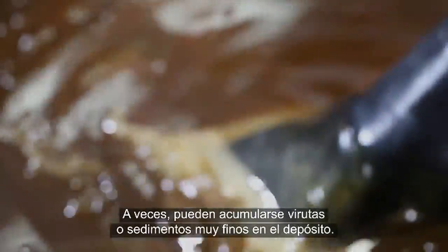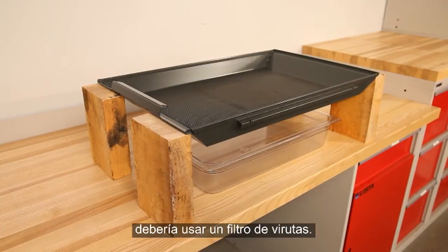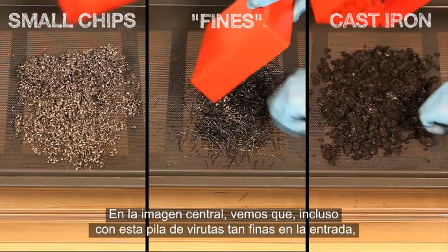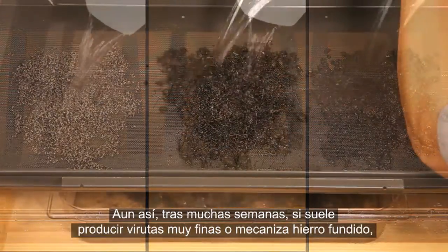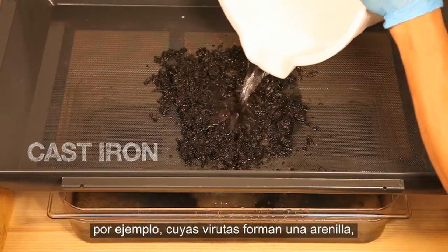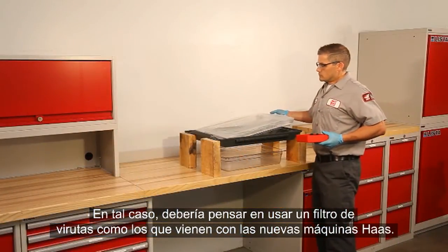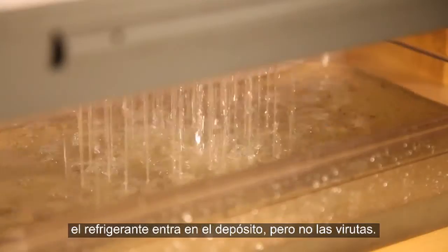Sometimes really fine chips or sediment-like contamination can reach your tank. Let's take a closer look at how the coolant inlet panel works and when you need to consider using a chip strainer. The perforations on the coolant inlet panel are very small and do an excellent job of retaining even fine chips. Even with a pile of fines sitting directly over the inlet area with coolant passing over them, only a small fraction of chips make it into the pan. Despite this, over the span of many weeks, if the chips on your machine are extremely small — or you are machining something like cast iron where chips form a grit-like substance — a larger quantity of chips can gradually build up. In this case, you should consider using a chip strainer like the ones that come with your new Haas machine, stretched over the supplied chip basket and placed above the inlet panel to allow coolant through while keeping chips from entering the tank.